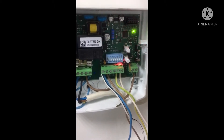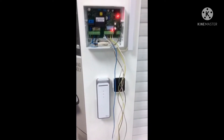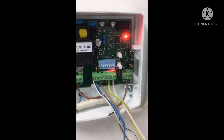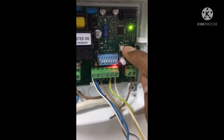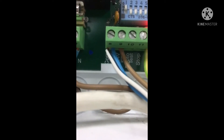Now it is a completely fresh control board. This MC 200 is installed in a rolling shutter and we are going to use two types of remote controls and photo cells. For the connections: button T1 is used to adjust the limits and working time, and button T2 is used to program the control board — adding or deleting remote controls and radio functions.